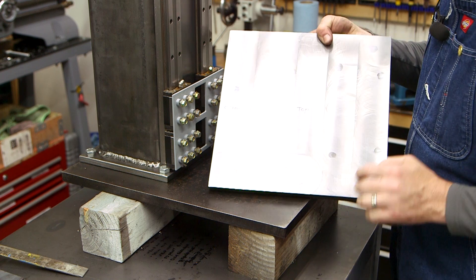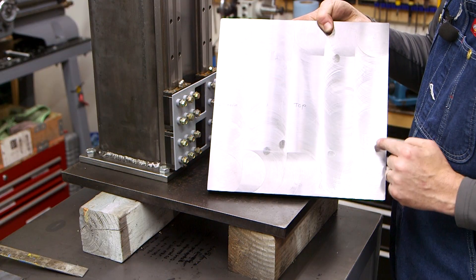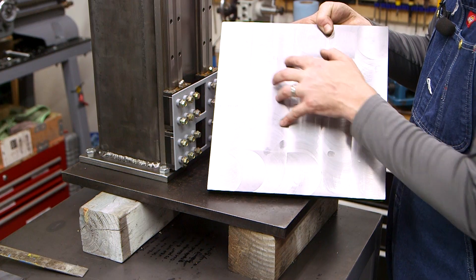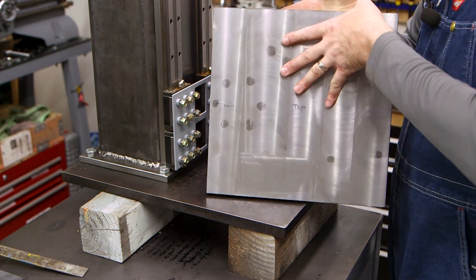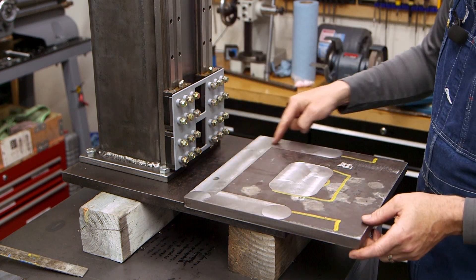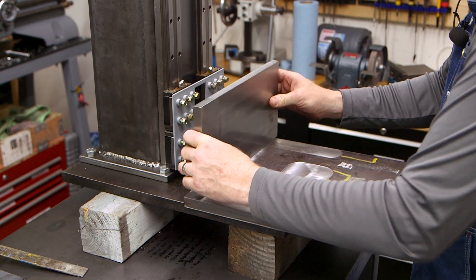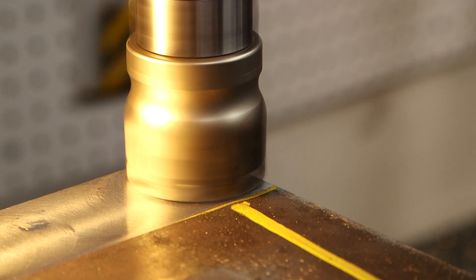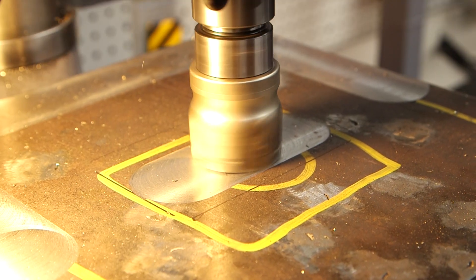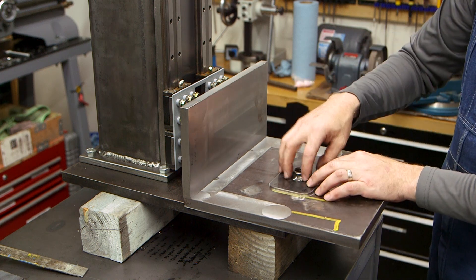Here's how that table turned out. I was able to mill it flat using a 3-inch shell cutter. You can see where the welds are — these were the holes I welded shut. The welds are harder, so when the cutter ran over them it resulted in a slightly different surface finish. Flipping it over, on the backside I milled out a couple of spots: this back portion allows the back plate to bolt square, and this center portion will carry the mounting bracket for the linear screw, which will bolt in place and the screw will be attached at this point.